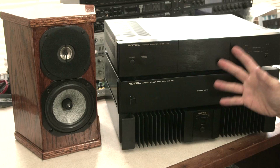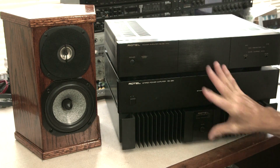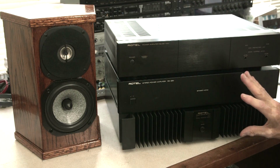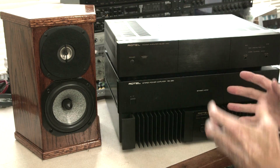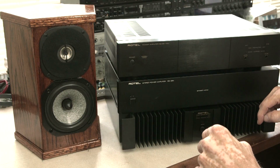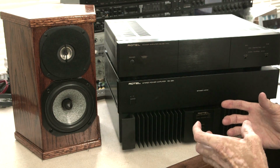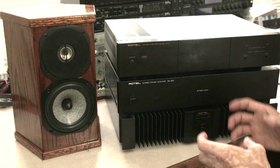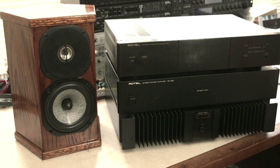So knowing the amplifiers matter, I was thinking about some other options. So one option is to get a tube amp, and there's a manufacturer out there that's making the old Dynaco ST70. It's a traditional tube amplifier with 12AX7 front stage and then push-pull 6L6. That's what we use, the American version, 6L6. They use the EL34, I think, is the European equivalent. And that's very similar to a tube amp my father had us build back in the day.